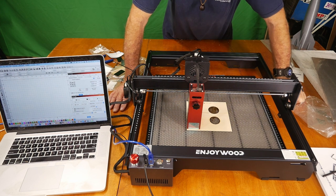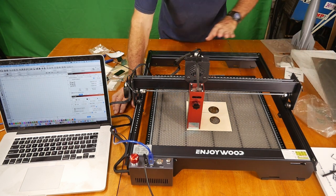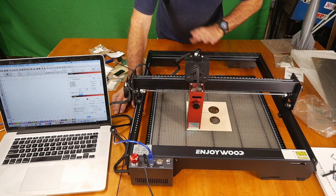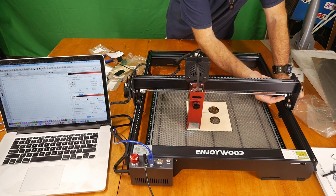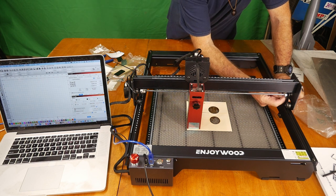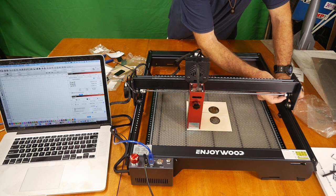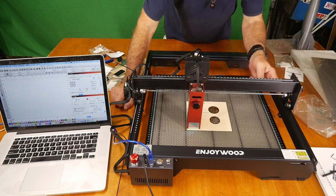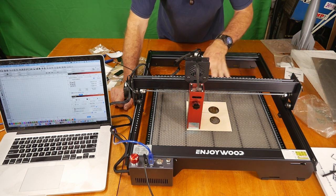Assembly took maybe 15 to 20 minutes — there's really not that much to it. There are two sets of screws on each corner to pull the frame together. One tip: do not put the back panel on before sliding the laser head onto the tracks with the wheels first, then attach the back plate. The only minor assembly issue I ran into was the belt not lining up. You want the belt snug but not real tight — almost a little sloppy — then release the coupling, slide it to align the gears with the belts, and tighten it up.